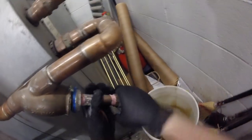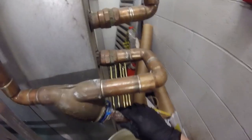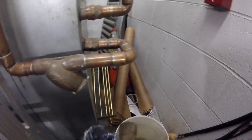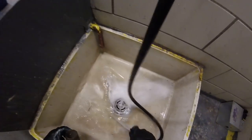Since this system is water-cooled, you know there's a cooling tower hooked up with this system. This is for the high side — that's why we might run into high pressure; this is for the condenser. A water-cooled unit means you have a water-cooled condenser. Here's the strainer — let's pull it out and find somewhere you can clean it. I'll pressurize the water to flush it.